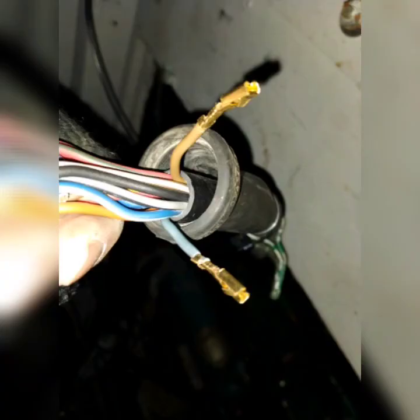So what we did was break into the Volvo Penta wiring loom to access two new wires. These new wires were for the oil pressure gauge and the water temperature gauge. Now, funnily enough, we go from quite a basic panel to a far more deluxe panel, and the only thing that we're going to have to do is to change these two wires.